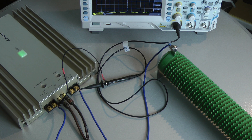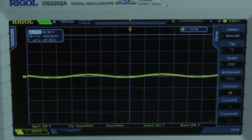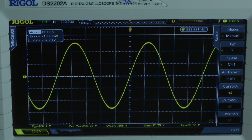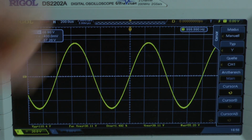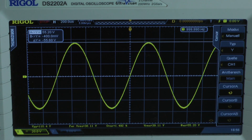Now I connect the 4-ohm resistor bridge mono to get the output power into 2 ohms per channel, both channels driven, continuous 1 kHz. After reducing to avoid clipping, I get a nice sine wave signal reading 55.2 volts. The amplifier delivers 195.3 watts into a 2-ohm load per channel, both channels driven.